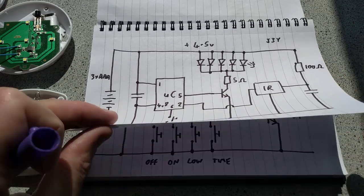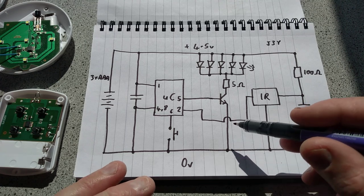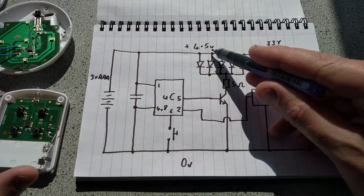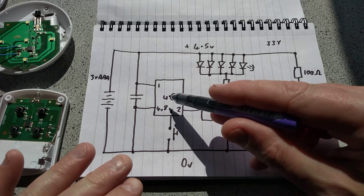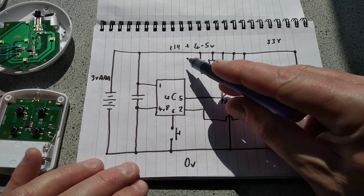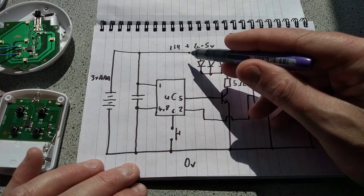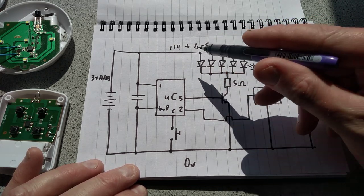That was the transmitter, and now comes the receiver, which is also quite textbook. The receiver is based on the same style of microcontroller, same sort of pinout arrangement. They've got three AAAs making a power rail of 4.5 volts. They've got the decoupling capacitor mounted very close to the microcontroller. The reason for that is that it avoids any sort of switching noise, pulses, on this rail, particularly when this is in pulsed modulation mode and this transistor is turning off, and it creates a slight modulation because the current through these tracks is pulsing with the current flowing through the LEDs.